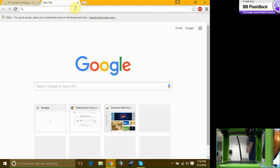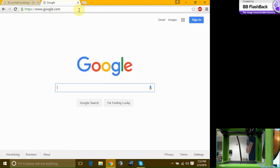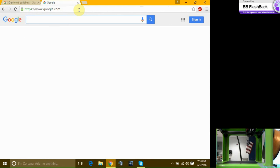There probably needs to be another step afterwards. No, there's 50 steps with this post-processing, everything. So, the best surface finish. It's strong, resin is stronger. What else? It keeps your tolerances, doesn't have shrinkage. Because it's a thermoset, if you want to go into the material properties of a thermoset versus thermoplastic, thermoplastics will shrink, thermosets do not. But once you make something in a thermoset, that's it. You can't remelt it. You have to smash it up and throw it out.